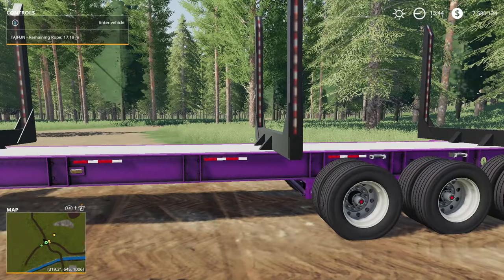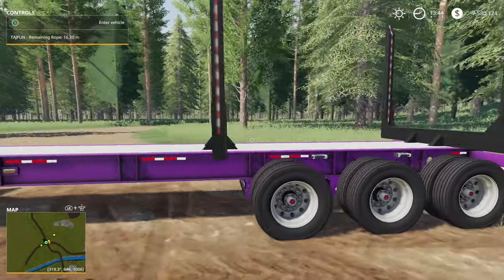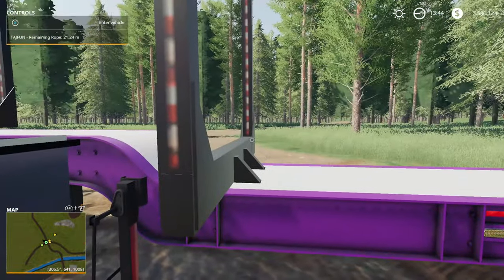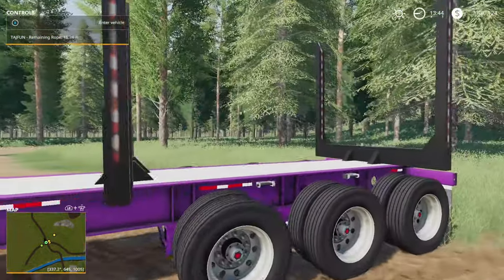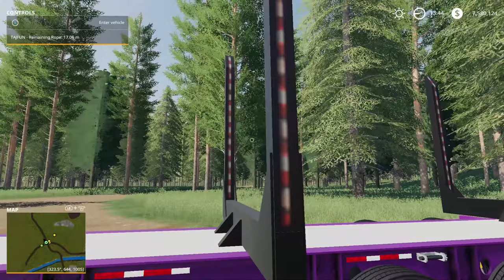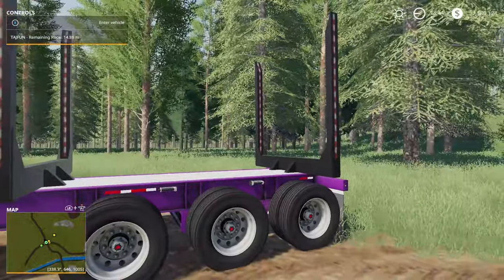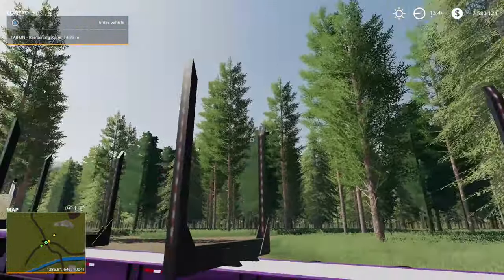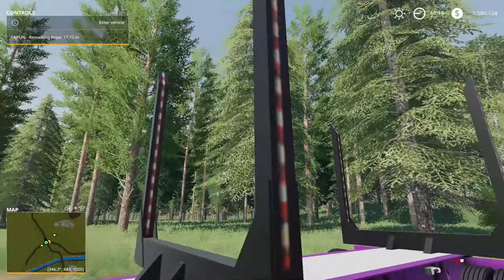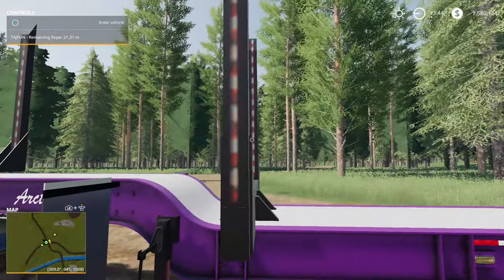If you ever watch my other videos, and you heard one of the truck drivers say belly load it, that means you put some wood right here. This is what you call the belly of it. They tell you to back load it some. You'd put it back here, put about a quarter of the bunk full of wood, and you drag your longer stuff. You typically put your shorter stuff on the back, and you bring the longer wood all the way up to the front and let the tops of the trees rest on what you have put up in the belly up here.